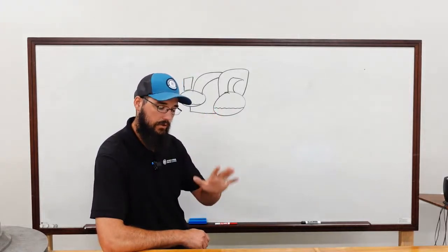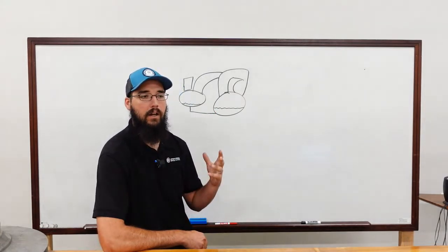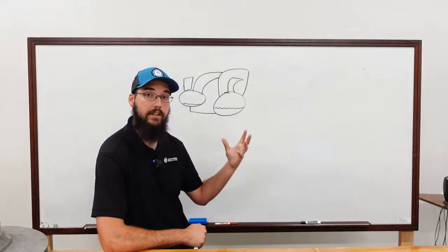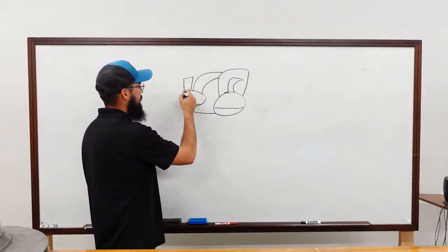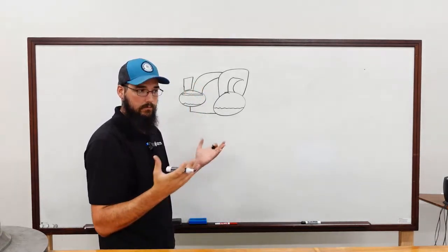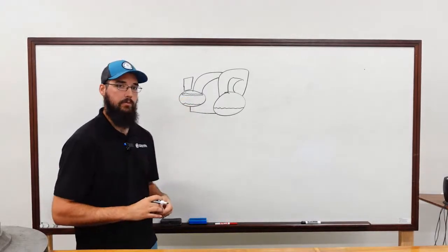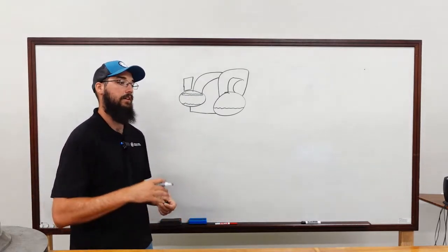Regardless, when those leaks are there, you're sucking air into the system. And we have to be able to get that air out, because non-condensables will stack in the condenser, because that's exactly what they do. When you get a non-condensable in the system like that, it will just eventually build up until you've got so much literal air in the system that it can't properly heat exchange anymore. You're going to see your approach value significantly increase.